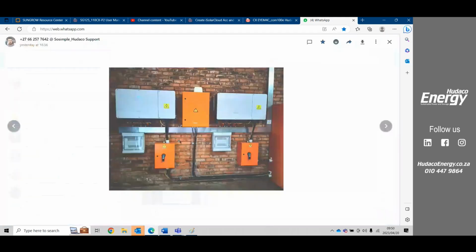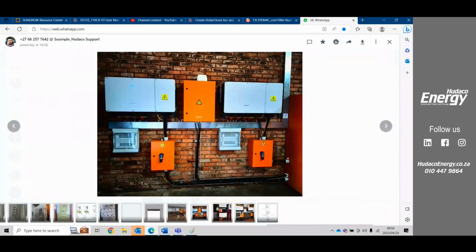They were bragging a little bit more about their installation. And here also, once again, spacing hasn't been observed; they never read the manual. It's very neat. It looks nice, but here's a service tray. That service tray cannot be accessed. The service tray for the fans needs to come out. So yes, nice installation, but wrong.